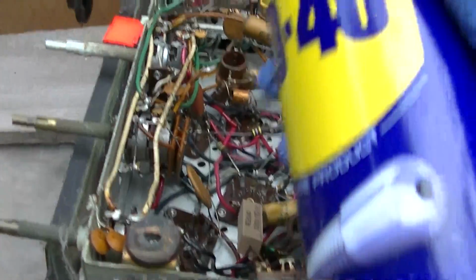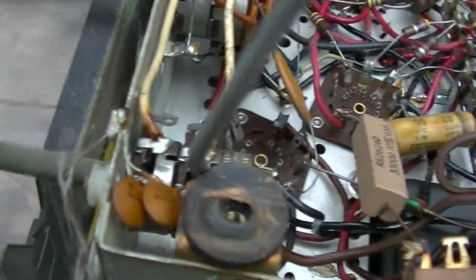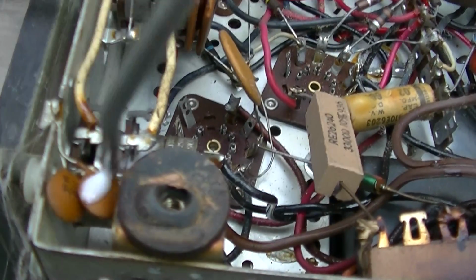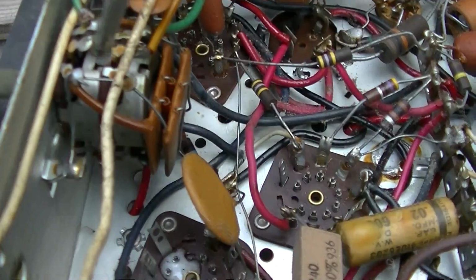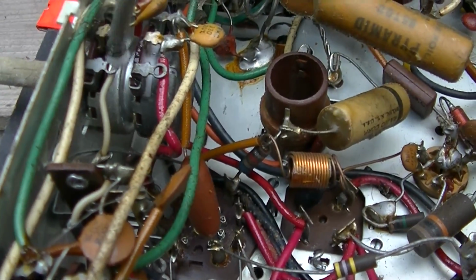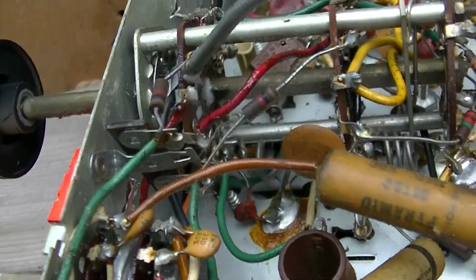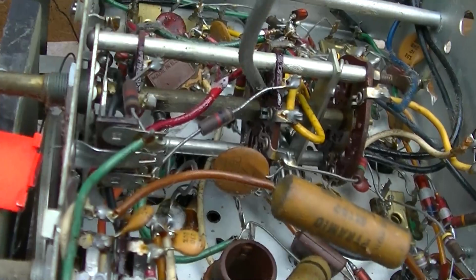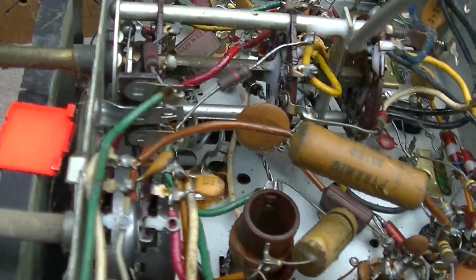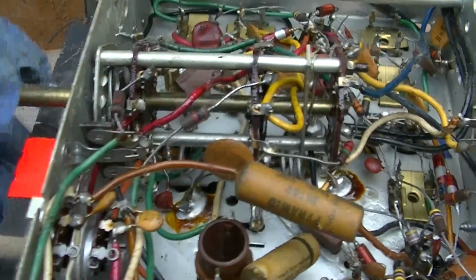First thing we're going to do, and I'm just going to use WD-40, is we're going to hose down all the pots. I ain't using my good control cleaner on this here spider tray. You just squirt it in these holes here. And then on this, you just kind of clinko-twinkulate all of the different wafers. Not a lot to it. And then you just work it back and forth. Well, the WD-40 drips on the spider egg sacs.